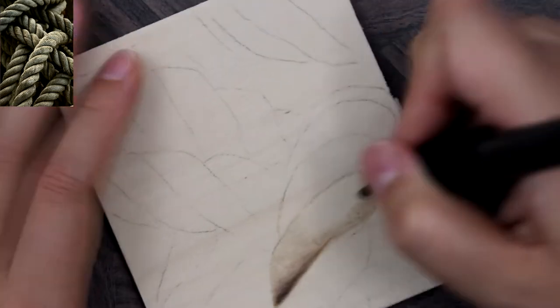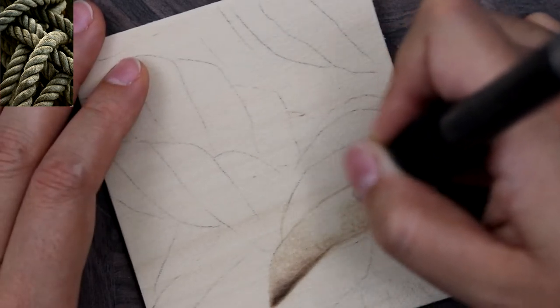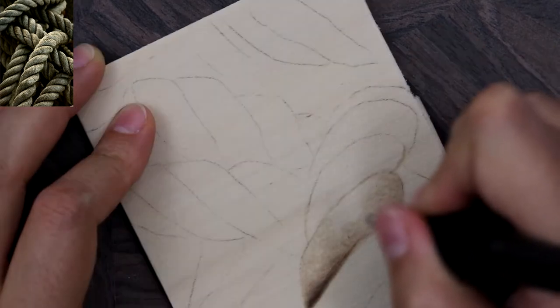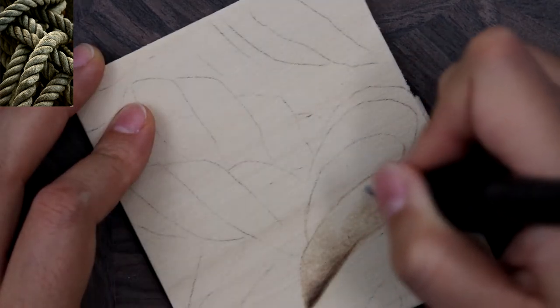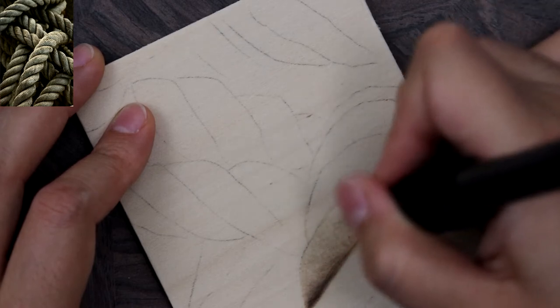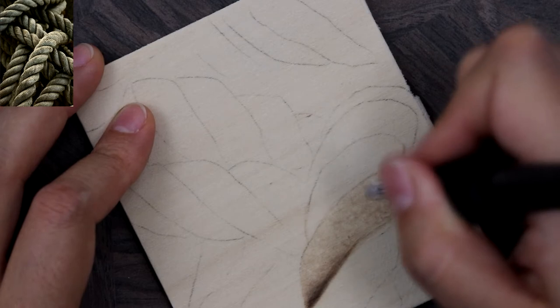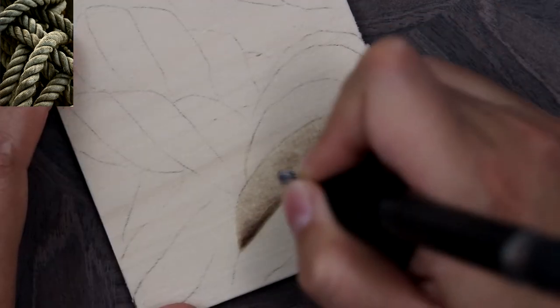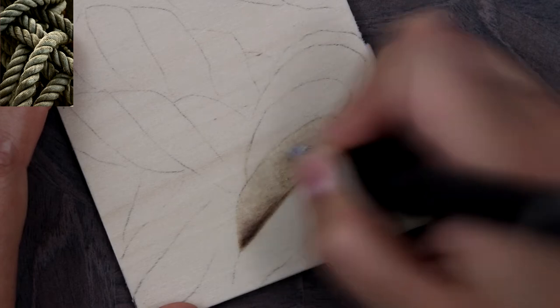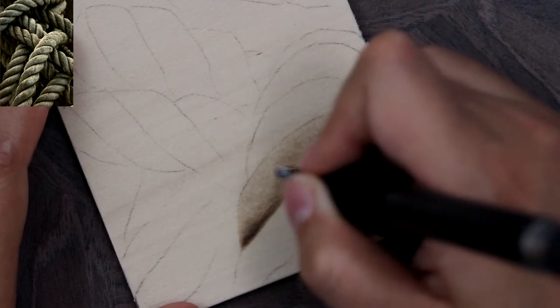If I want to burn dark, I'll just burn slower over it. I never really go higher. I find that when I go in the 6 plus range, you start leaving a very noticeable texture on the wood, which when the light shines on it, makes it look really shiny, which I'm not a fan of. I like the matte look, but especially with sappy wood, it's unavoidable.